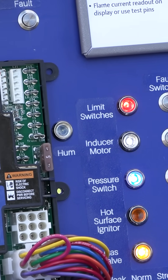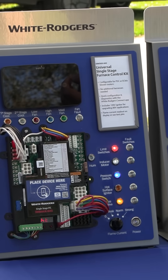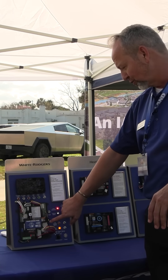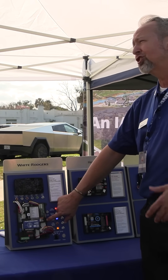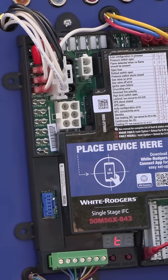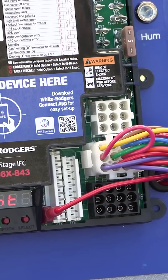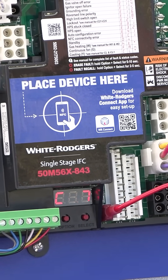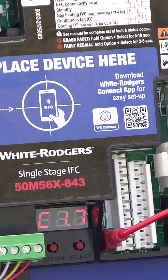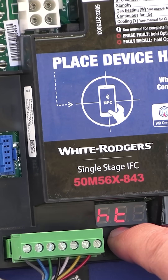How do I know my flame sensor is sensing flame? What is flame sense and how do you measure it? You used to need a really expensive meter to read microamps — but no, that's a thing of the past. With our controls we have test pins that you can use with a standard DC meter. Put your test probes on each one of those leads — one volt DC equals one microamp. But better yet with this model, the digital display is actually giving you a live reading. In live fire it's flashing between HT, standing for heat mode, and C, standing for current, and the actual reading. Right now we're at a fairly normal reading of 1.6 — 1.7 is where that should be reading.